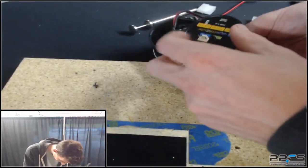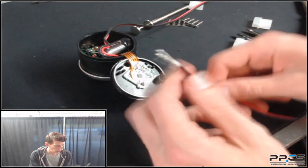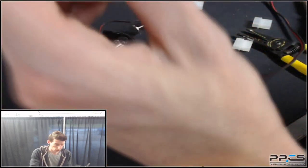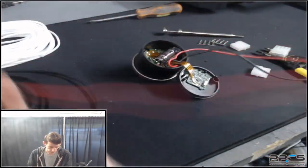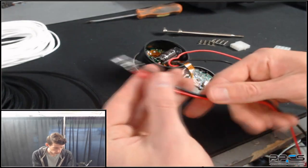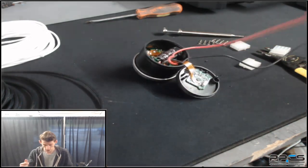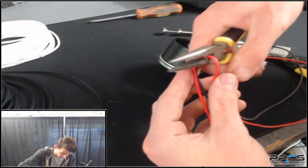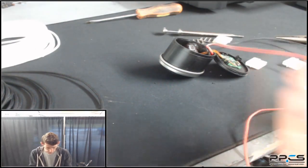Alright, we got a quite a bit bigger hole now, so it should accommodate the wires and the sleeving. This pump just has the two power cables — everything else goes to the PCB. I'm going to individually sleeve these, so you do have to separate the wire — it's just a pull and peel. I'm going to cut these down because I don't need a cable nearly this long in this system. Customizing the length of your cables while sleeving is a good idea — measure it out and see what you need. Then just take your needle nose pliers with the cutter and make the cut.